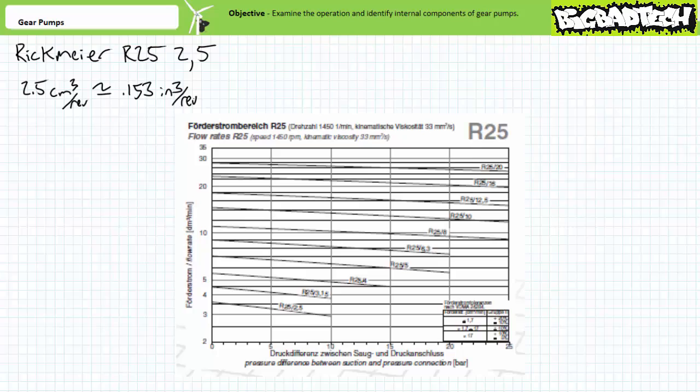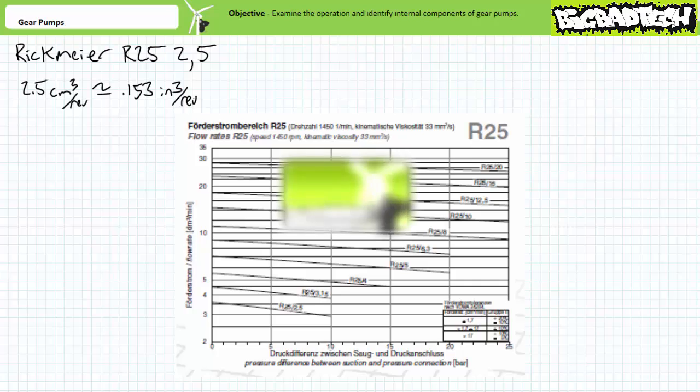A 3-phase AC system at 60 Hz might see a 2-pole pair per phase squirrel cage induction motor rotated around 1740 RPM, thereby skewing the flow rate curve upwards, given this is a fixed displacement pump operated at increased rotational speed. Lectures on motors and generators will discuss how pole pairs per phase and excitation frequency affect synchronous speed, the speed of the rotating magnetic field for 3-phase AC systems.